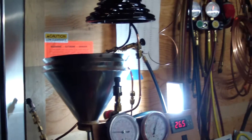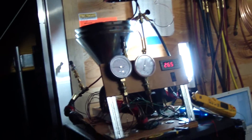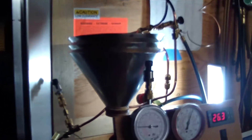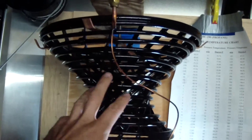Hey, Mike here. So we got another little experiment going on here. I built this over the weekend, got the idea last week. We got the R290 refrigerator here, little mini fridge, not great lighting. But what we're running is on the condenser side, we have a heat exchanger here made out of these sheet metal cones and then a thermosiphon utilizing the static condenser that I built a few weeks ago.